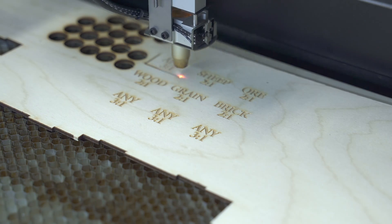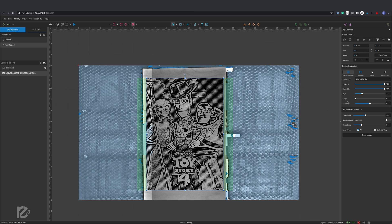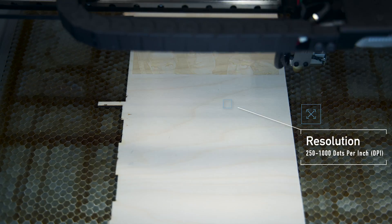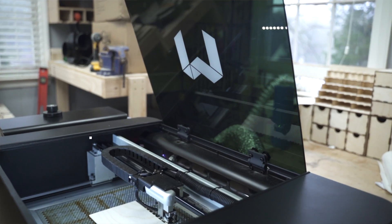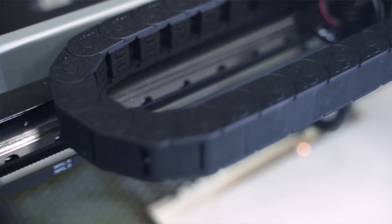You use a laser for two things: engraving and cutting. Cutting uses vectors; engraving is where you get a picture — whether a solid black section or a grayscale image using dithering, where closely spaced dots give different shades. The max resolution is 1,000 DPI, which is great since print-quality is typically 300 DPI. The machine weighs about 54 pounds with an all-glass lid. X and Y axes use stepper motors on linear rails with belts — same as my other units — and the belts have been running fine.